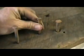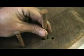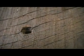These old cut nails are extremely brittle, so a lot of times instead of pulling the nails out what they would do is simply hit them with a hammer and snap them off. So for example this hole here — you don't really see anything in it, but there could be a piece of a nail hiding in there. Most of the time what you'd have to do is dig out around the nail, expose it, grab ahold of it and yank it out. That takes a very long time and also ruins a lot of the wood in the process.